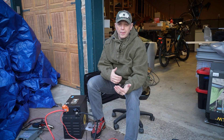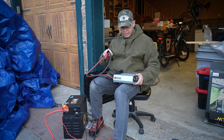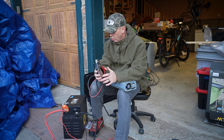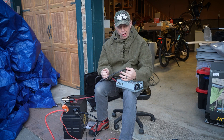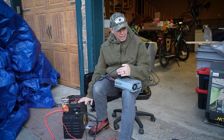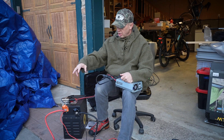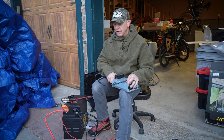Lastly, I want to be able to plug it into my house when I get home, and the way that we accomplish that is with a charge controller like this — this is an Iota charge controller, it's a good company. All that's going to happen eventually is I'm going to replace these alligator clips with a physical mount to the battery and then we plug it in. This way when I get home I plug it in, charge the battery up off of my house, and then when I'm out in the wild I run the solar off of the camper itself to trickle charge the battery. When I need to discharge, I run my 12 volt right off the battery and my 110 off of the inverter.